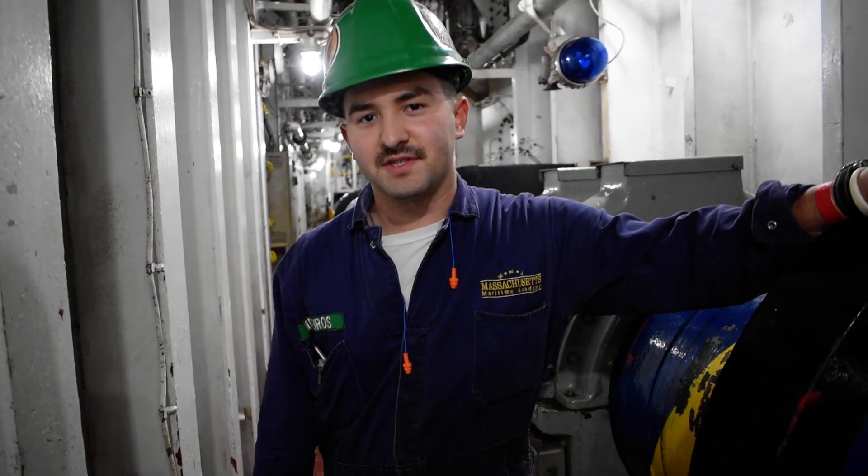Why do you need to know about the counter? Why is that important? We use it for log purposes, and we can use it to calculate efficiency. There's a certain amount of slip with the propeller where it's not doing any useful work, and we like to know that so we can adjust our speed accordingly. It also helps upstairs in the deck department when they're charting and plotting.